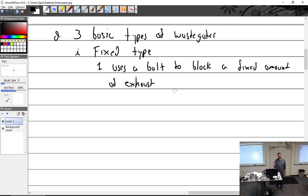Number one, you're probably never going to get that bolt to move. I'm like, that is a good point. You guys ever try to take an exhaust off a car? You need what they call a Victor wrench. Victor is the one that makes cutting torches. So you don't usually undo bolts that have been in an exhaust system in operation. This one is directly in line with the exhaust, with the threads and everything being blasted on. You're not going to move it.